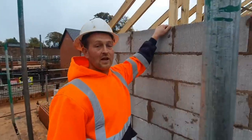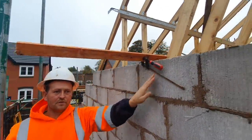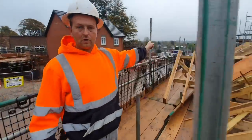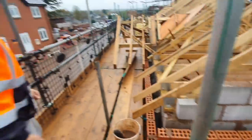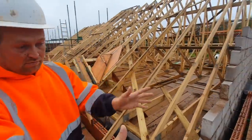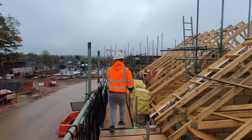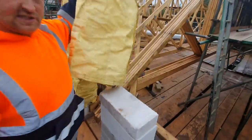We're going to put another course on here, but it was windy last night so what we've done is put a clamp onto the truss, put one over the front of the brickwork — that stops your brickwork going forward and backwards when it's wet. While I get that blockwork up over there, we'll load this through with bricks. The only problem is all our blues are in there and they're nice and wet. If you can get them put out here and dry, put everything under bags. One thing we don't do very much, but now it's back into this.